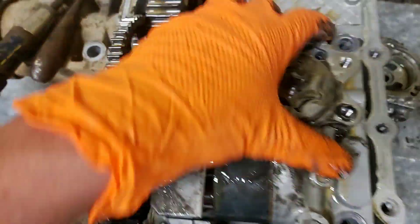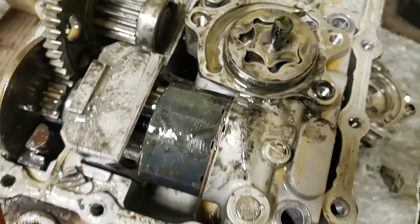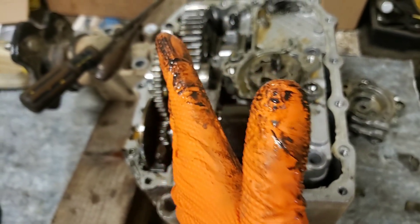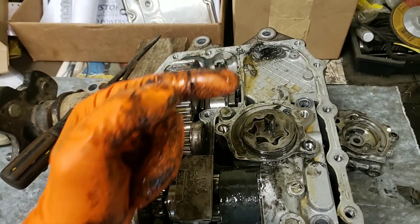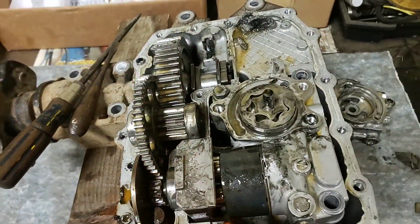So that's the charge pump side. Then we have our swash plate pump here, which has a manual side lever — I'm not going to be able to fully actuate it because it's all jammed up. This pump is currently in the neutral position and it's flat. If we move it one way, it starts having a pumping action and moves forward. If we angle the swash plate the other direction, it starts to transmit power in reverse. Let me get the rest of this apart and we'll do part two where we look at the swash plate pump a little bit closer so everybody gets an idea how they work.